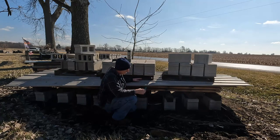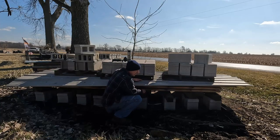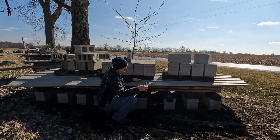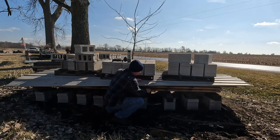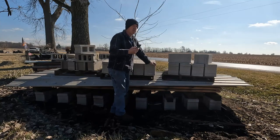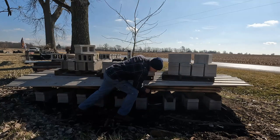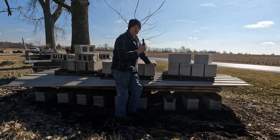This is oak. I've got it set on number 2. And here's what I like about it: I can stick it in, I don't have to see, and then I can press the button and it'll hold it right there. It's 13. I think we're going to be getting a lot of 13 in readings. Normally on a regular moisture meter, you'd have to get down here, stick it in, and then try to look at the reading. But I can just stick it in, press the hold, and it'll give me a reading, 12.5.